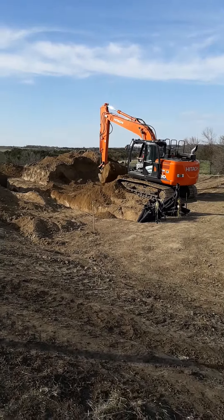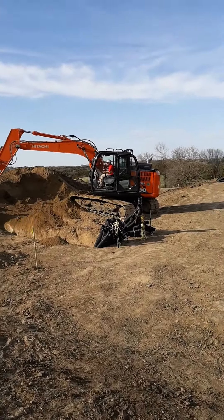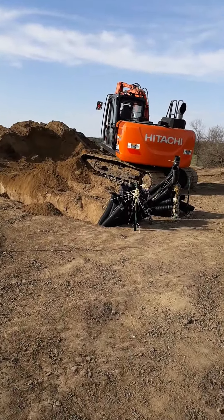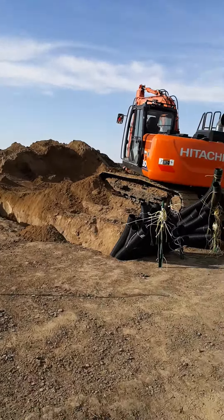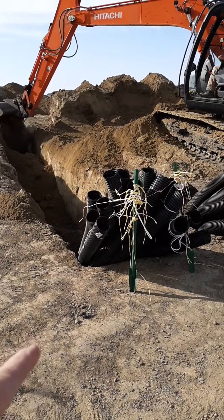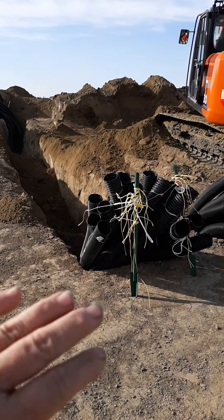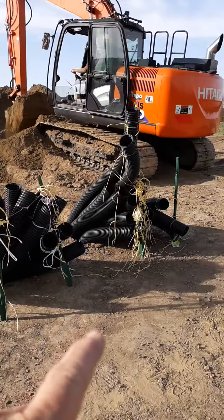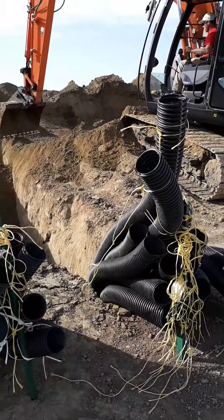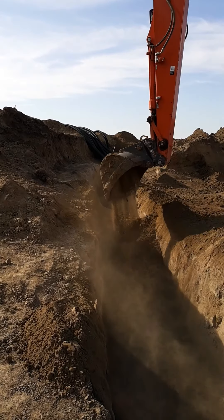The drain tubes are in the trench and Mark is just putting on the backfill dirt. You can see the group of 17 tubes that go down at about seven feet or lower, and then there are the other 17 tubes that are down 12 feet. You can kind of see how they're coming up over there.